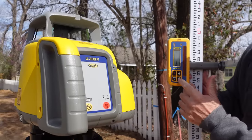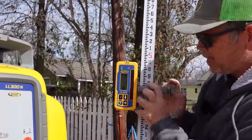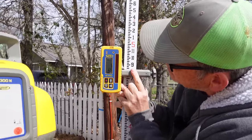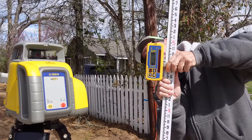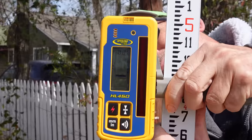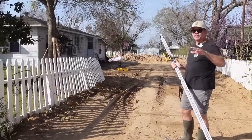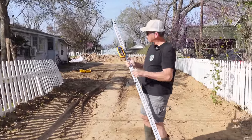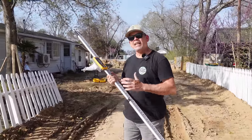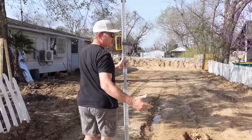We've got our detector — this is the volume control, it's pretty low right now. I'm gonna raise it a bit. I'm gonna get it perfectly even with the laser; it'll tell me up or down. There's even a scale on the back. Now that we have our baseline — the laser is about four foot nine above the sidewalk, dialed in on our pole — I'm gonna walk back to the pad and see how much higher we are than the sidewalk.